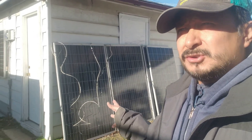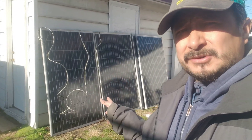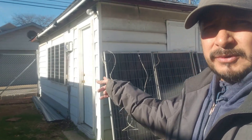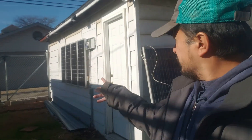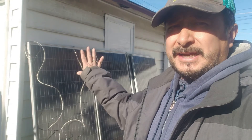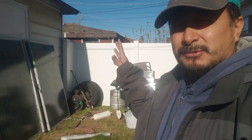These right here are getting 67 volts right now with really no sunshine on them. The voltage open circuit in direct sunlight would be 74 volts. So they are getting some voltage but not optimum. The other panels over there are actually producing 79 volts right now — they're in more sun. These here are in the shade. If I angle them to the side, they'd probably get more sun.